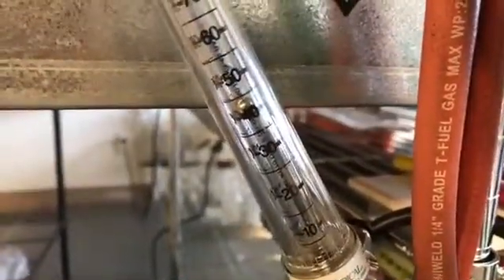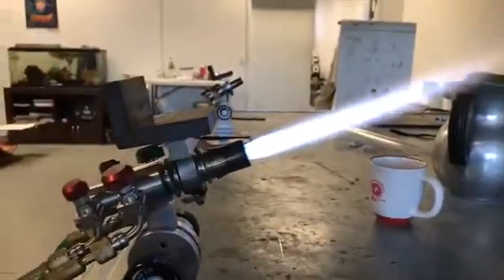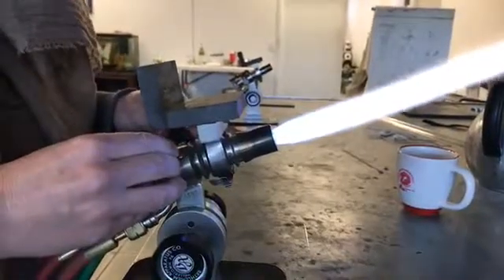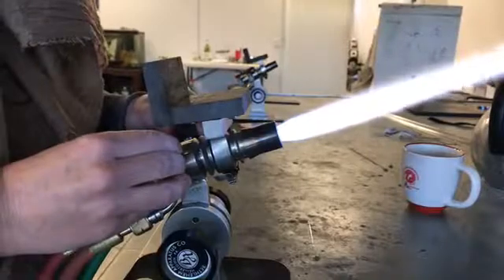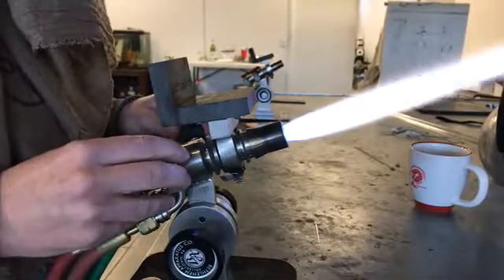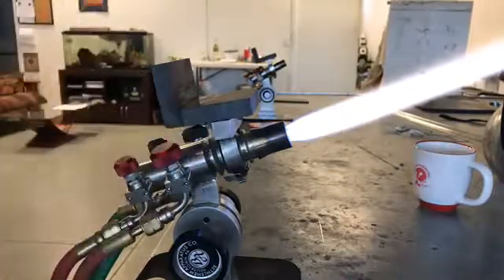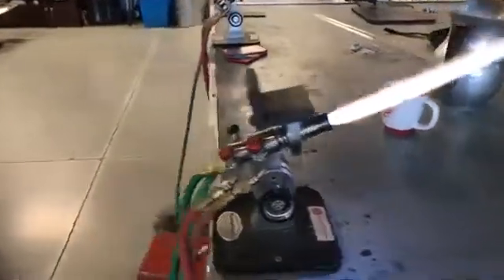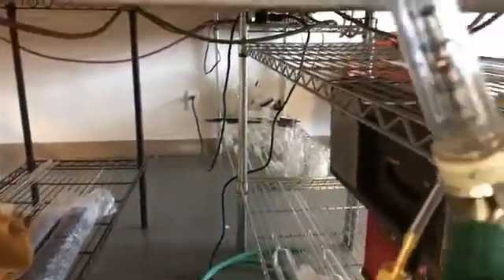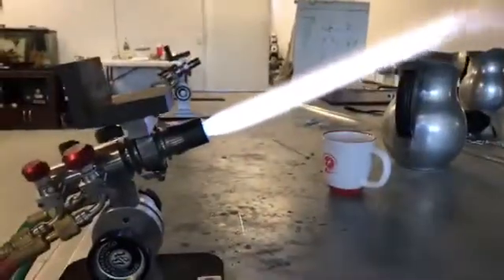It's sitting at about 40 liters a minute, so I'd say that's probably about the highest you're going to get with this Bravo — and that's a pretty ridiculous flame. I have not used that flame. Maybe half of that for me. 25 liters a minute — there you go, Bravo. Sorry, I'm not actually sticking glass in the flame at the moment, but that's how you hook up a flow meter.